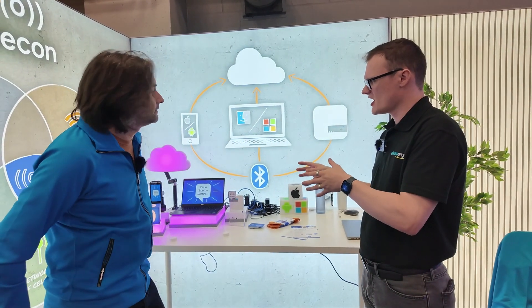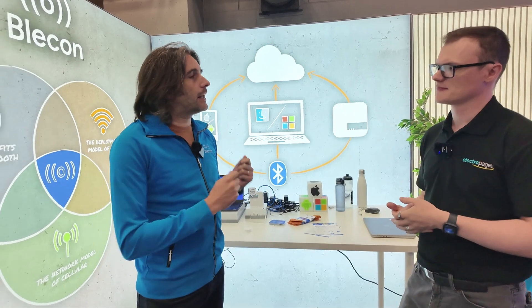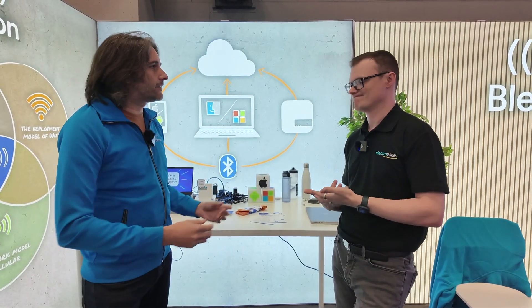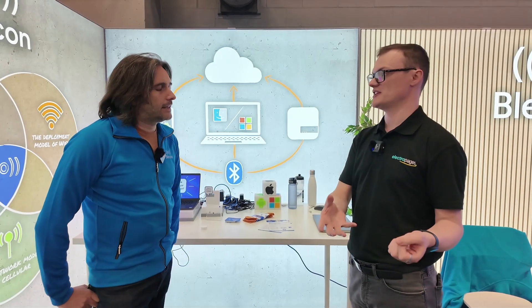Does it make it kind of like UDP — sending packets out and assuming they were picked up? The classical use of Bluetooth for beacons is more like that: tracking beacons historically just shouted, and if something spotted it you'd know it exists, but the device never knew it was heard. Ours is more like the model where you know that a connection has been made, so the hotspot communicates back to the device to say 'yes, I've picked up your message and it's now been routed.'